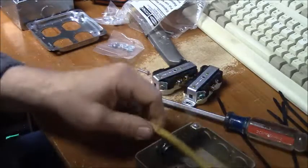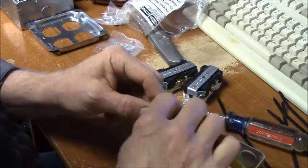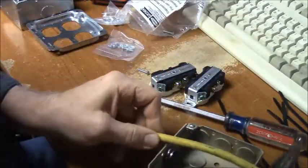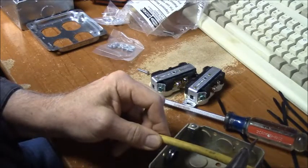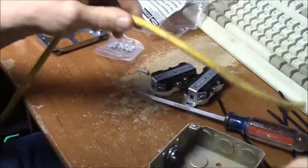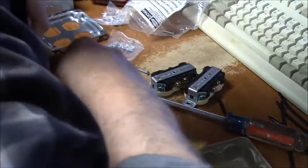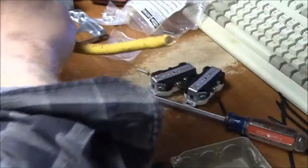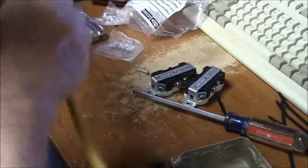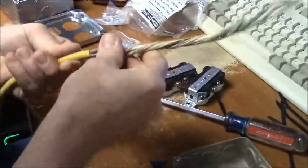I've got to think about how much lead I'm going to need inside. I've got a daisy chain up to two outlets, and I want to tie a knot in it. So, well, maybe I just tie wrap it down. Yeah, I'll try that. Okay, so I'm just rolling that through, scoring that. Twist it to break it free, because you definitely don't want to cut into your conductors and have them bouncing around inside. If you keep working this, it'll inch off and take it to a point where she'll slide off.